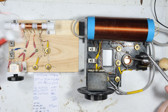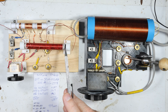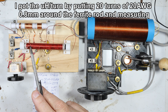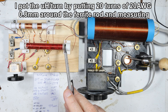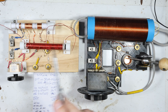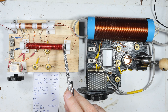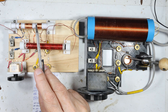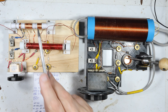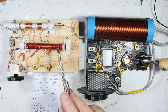That is exactly what I did — I took my ferrite core and wrapped it using those ratios: 21 turns, then 32 turns, then another 84 turns. The stuff on the ends is thread, which I found is a really good way to hold down the wire. My other idea of wrapping a wire around it and soldering failed because it shorts out the coil, but this works rather well and it's ready to go.